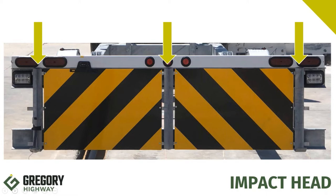This limited lateral movement forces the impacting vehicle to properly proceed through the impact zone of the TTMA 200 and begin the energy absorption process of the impact event. This process works with both straight-on events and impacts that occur at a variety of angles.